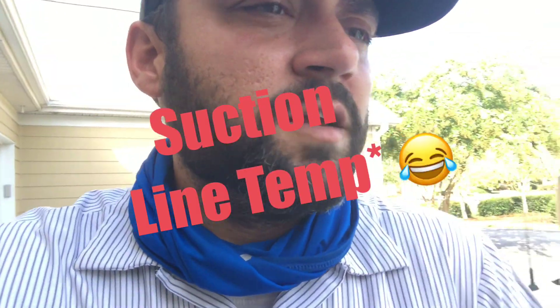After looking at all the pressures and temperatures, when you see that suction pressure a little higher than it normally should be — nothing real concerning — our wet bulb is about 62, probably should be closer to around 58 or 59. With that suction pressure up just a hair and the line temperature not getting where it should, it makes me believe the blower speed might be affecting it. It could be on too high of a setting for the CFMs and the ductwork. So we're going to go up there and look — more than likely it's on the highest setting for cooling — and we're going to bump it down and see how much that affects our pressures, line temperature, and Delta T.